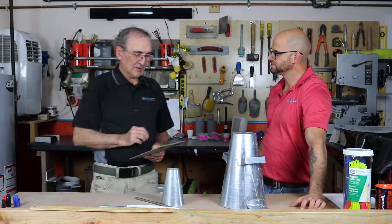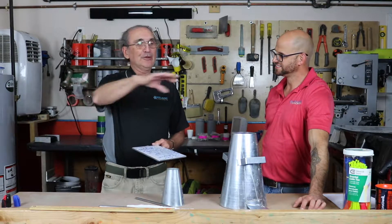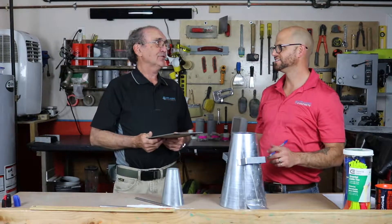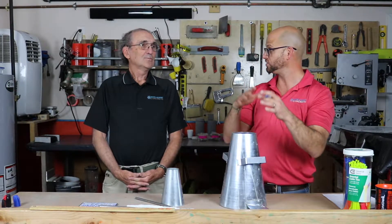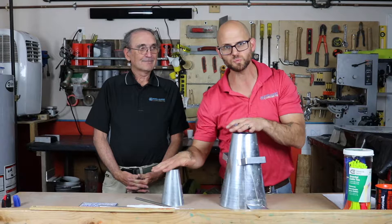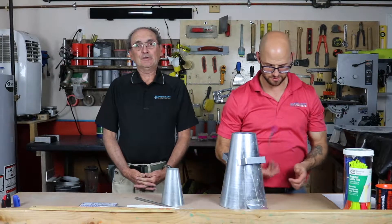When I've got my hard hat on and I have to check a box that says acceptable or not acceptable, I can't wait three days, seven days, or 28 days — particularly if I'm building a dam, 28 days later it's going to be too late and it'll be buried 20 or 30 feet down. I've got to have something there on the job site. That's David's role as engineer and the technician's role in using the slump cone. Both of us agree — it's a key piece of information. There are other methods out there, but these are powerhouse tests that should be used throughout, because they do great things for us on the job site. You've got to have some way to know if what you're putting down is what you're going to want in the future.